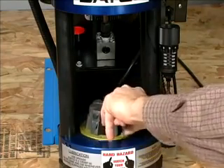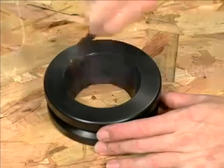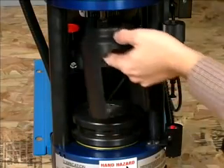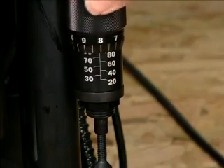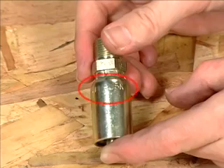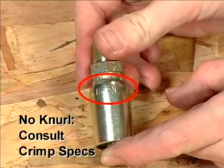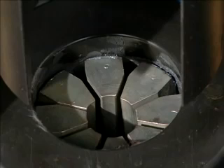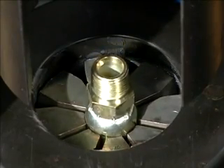Place the die set on the pressure plate. The ring goes on the bottom to enhance the visibility of the assembly being crimped. Lubricate the compression ring and place it on top of the die set. Attach the pusher to the stud at the base of the ram. Turn the micro crimp adjuster gauge to the correct setting of 77. Some DECO couplings come with a knurl on the ferrule to indicate the crimp length; on ferrules without knurl marks, consult the crimp specs for the proper position of the coupling in the dies. Looking down from the top of the die set, center the knurl in the tops of the die fingers.